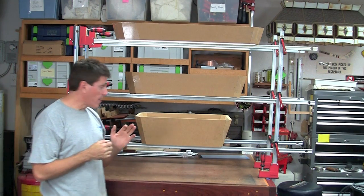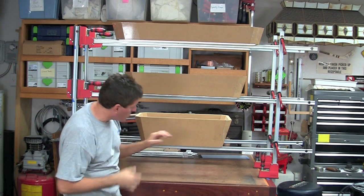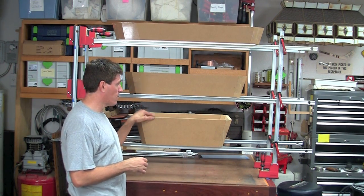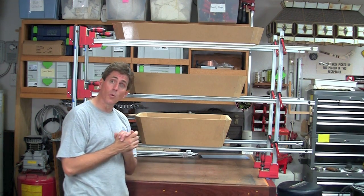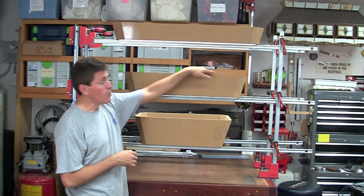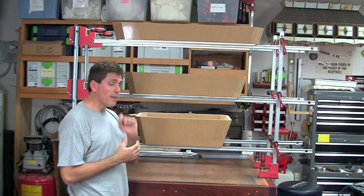So there are a lot of goofy angles involved. Now, everything came out really, really good when I assembled it with tape. A couple of these little bars here aren't quite level, I can see, because I'm getting some rocking. But when they're on the assembly table and nice and flat, everything snugs up just beautifully. So I know that the angles are going to work out just great, and everything is nice and flush even. So I won't have very much work to do with, say, a block plane to do any corrections at the end, which is exactly what I'd like.